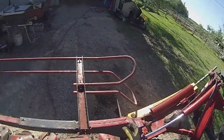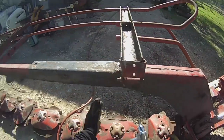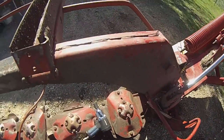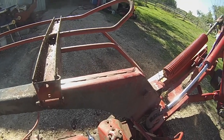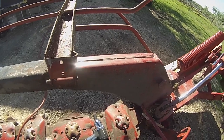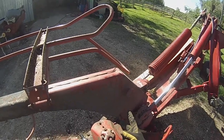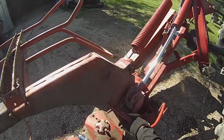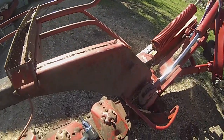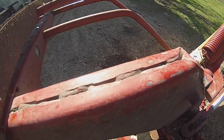Well, got the first top off, so we're gonna pull this off. I got them aligned, so it's up, down, side, so easy to put back together. 3/4 inch, four bolts there, take them out, not a huge deal. These units, I actually always have two Shock Pro hubs, so if I do hit something, at least I can just basically zip out these four bolts. Pull the hub out. There's a middle bolt in the middle here. Pull that out, throw the new Shock Pro hub in.